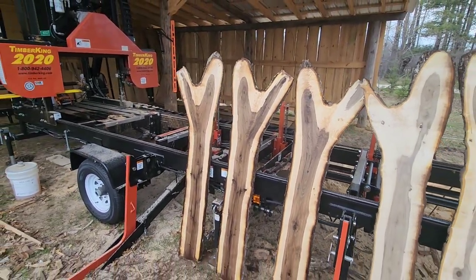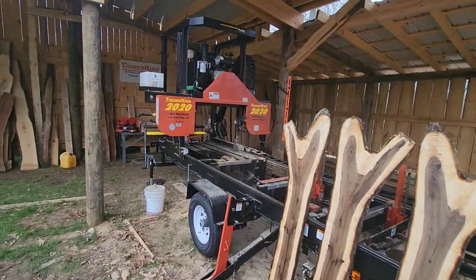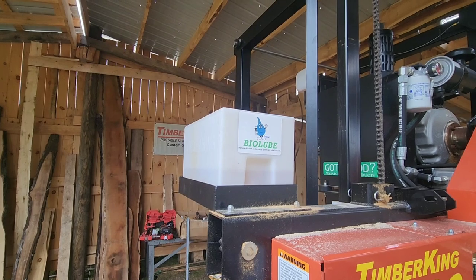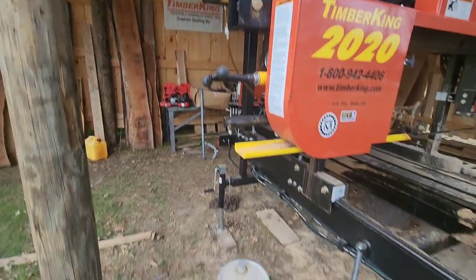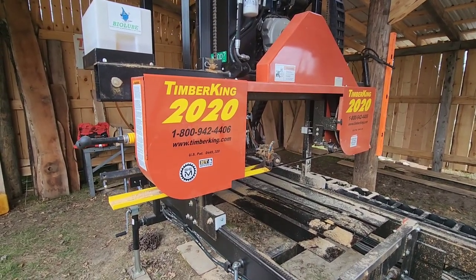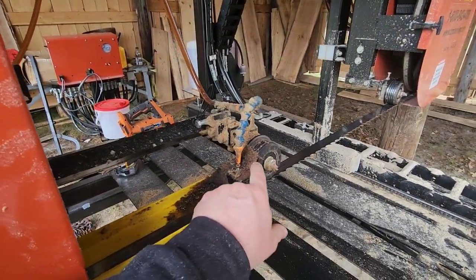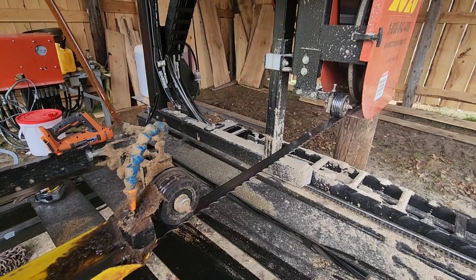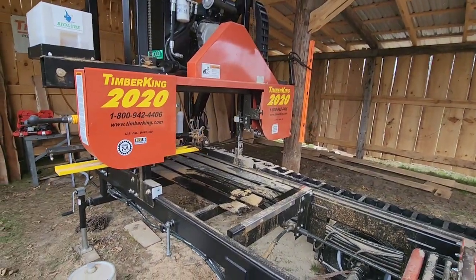So that'll be another video sometime down the road. I appreciate you staying tuned and watching. I hope you enjoyed and learned something — we have many more videos coming up. One of the upcoming videos will be about what's inside my lube tank up here. The fine folks at BioLube — I'm testing out BioLube GP right now. It's an additive we can use instead of diesel because the smell of diesel was getting a bit intense. With Gary Atkinson's felt pad design plus a little modification I added, the blade and my guide rollers are staying clean, and my blade's not rusting because it's being oiled. Please like and subscribe — we'll see you around. Thanks.